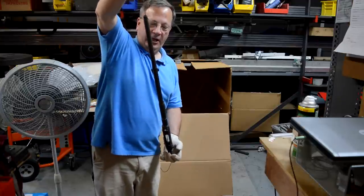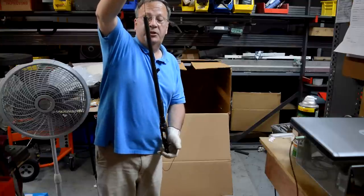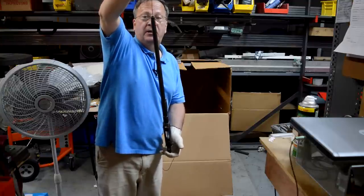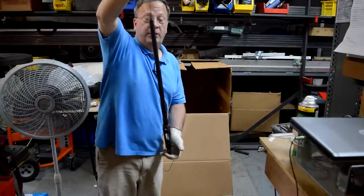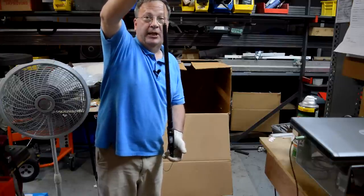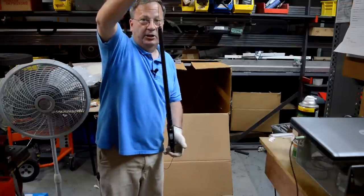Okay, so we're going to take our barreled action out, and we're going to take it to the steam pipe, and we're going to steam it under high volume of steam for about 10, maybe 12 minutes. And when we rejoin you, the barrel will be cooled down, out of the steam, and we'll be carding it and let you see the color.